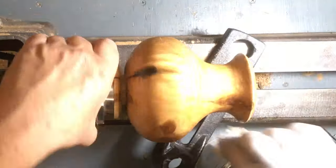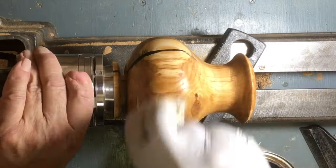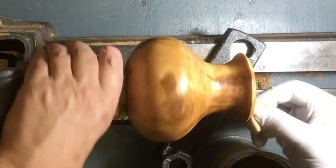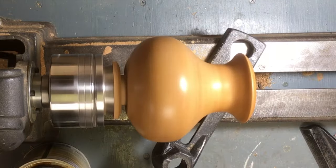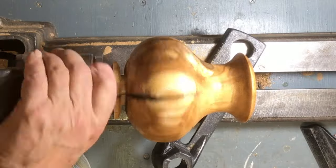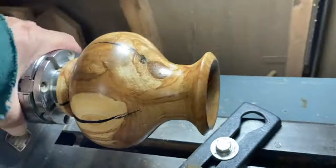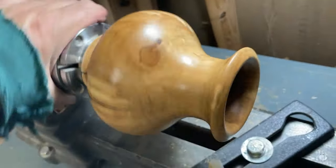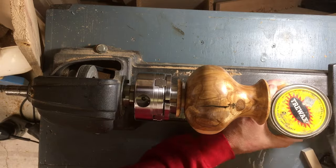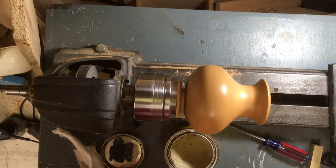You can see as I'm turning this that it still had quite a bit of epoxy and CA glue on it — this is the first application of shellac. The subsequent applications after sanding took care of all that bleeding that was happening from the black dye in both the CA glue and the epoxy. As I continued to turn, sand, and shellac it, the definition of those lines between the epoxy and the wood got more defined.